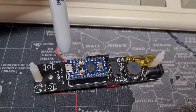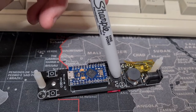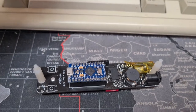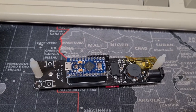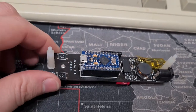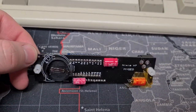And the Arduino Pro Micro, so I can program the thing over USB, set the clock — that will program the real-time clock chip — with a quick web script or a Python script or something. Then it will run happily for years. I've got another one going for a couple of years that keeps really good time, so I'm very pleased with those. I think they're temperature compensated as well. And there's a battery on the reverse side of the board that keeps the clock running when it's not powered.